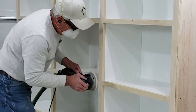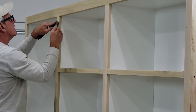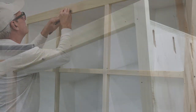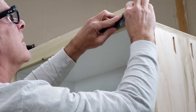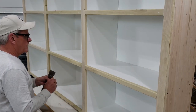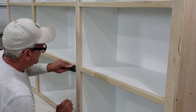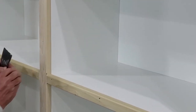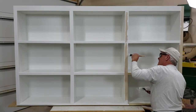As I'm doing the final prep before painting the face pieces there are a couple of options for filling the holes made by the trim nailer. I could use a wood filler, which is what I would definitely use if I were going to be staining the pieces, or I could use painters putty. My preference is painters putty, particularly since I'm painting the surface — it's a little easier to use than wood filler. To give these boxes the look I want I'm running a thin bead of painters caulk into all the corners, the same process I would use caulking tile: put a bead in the corner and wipe away with my finger, just leaving enough in the corner to make the joint disappear. The caulk is a perfect match with the paint, but if it weren't I would use a touch-up brush to make it blend in. After a couple of coats of paint on the trim the units are ready to set.